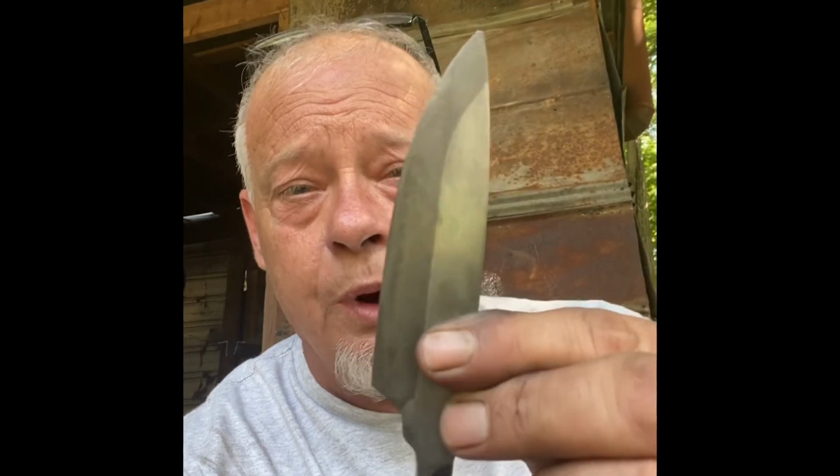Went ahead and hardened it, cleaned the blade up, did a test etch, and here it is. Now mind you, this steel needs to be tempered and then we'll have to clean it up again. But you can plainly see the line where the mild steel meets the high carbon. Now, I think that turned out really well.